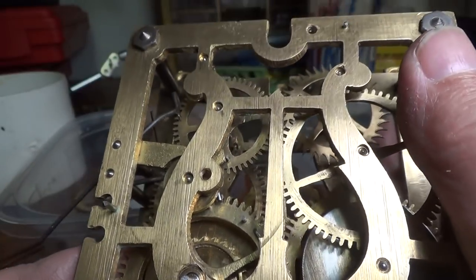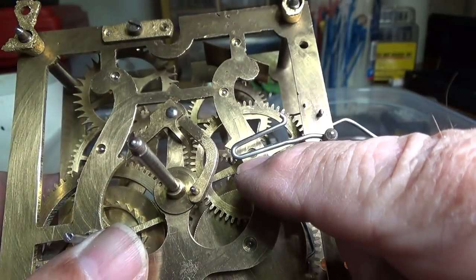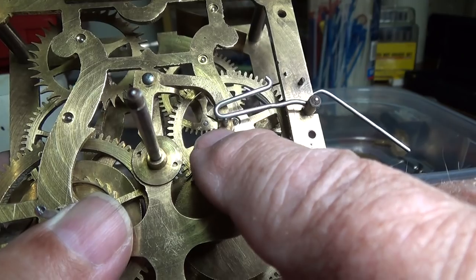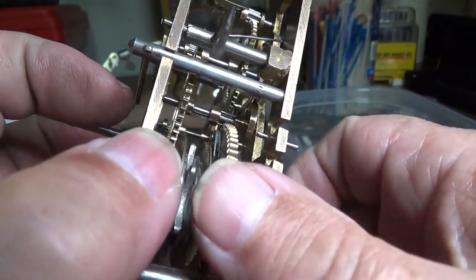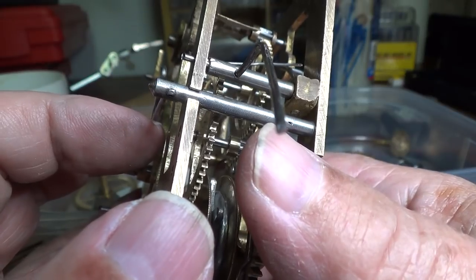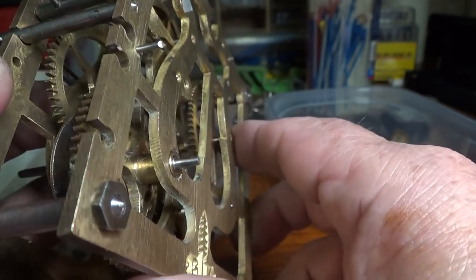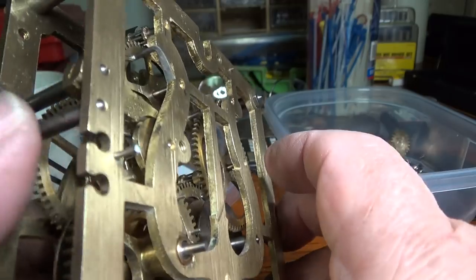Okay, so put pressure on the wheel, hit this, and then this goes into strike. Actually this little lever pin here will go inside there. And we'll deal with that shortly. But this gets lifted. When this gets lifted, that lifts another little lever that goes up to stop the warning pin, which is right now not in the right position. At the same time, it lifts the brass pin out of the way, and that goes into its run cycle.